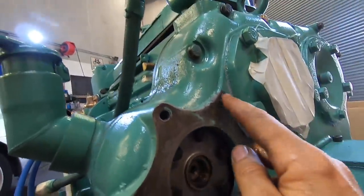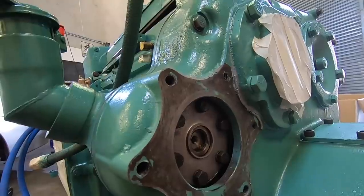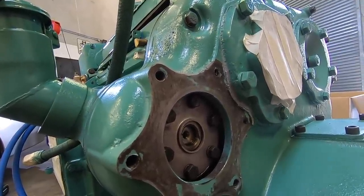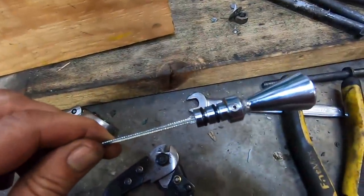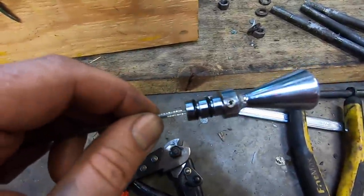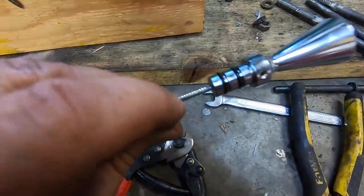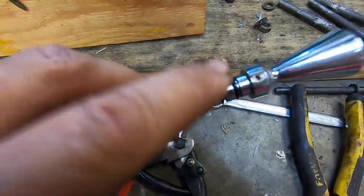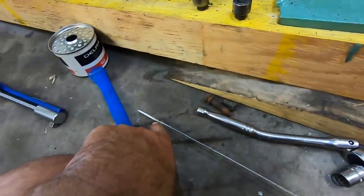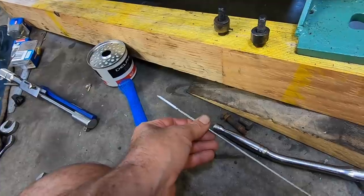All right, we're going to need a new gasket for here. So I'll either make one or order one. I'll see how long it takes. A couple of viewers commented that with these sort of aftermarket dipsticks, there's a little Allen key here, so you can take the dipstick out, cut this end, put it back in as a way of adjusting it to be the correct length, so we don't have to do any dodgy marking at all. So, perfect.